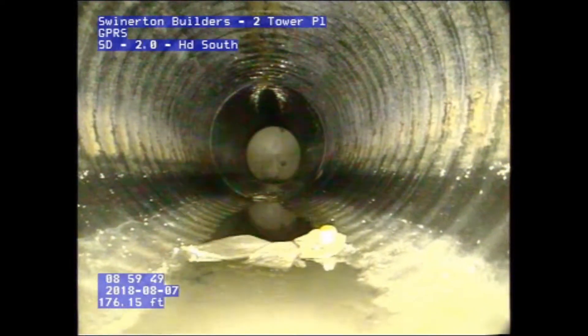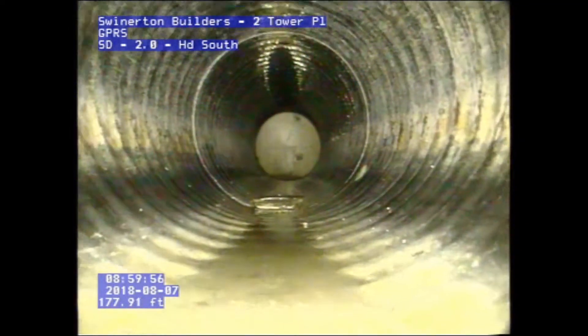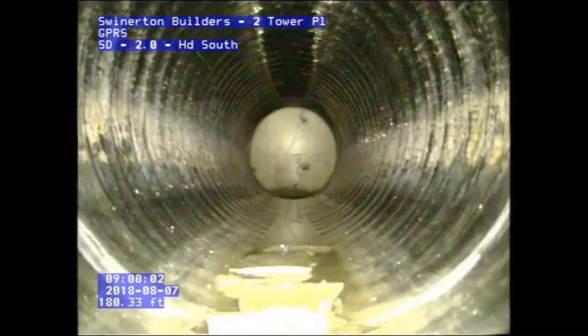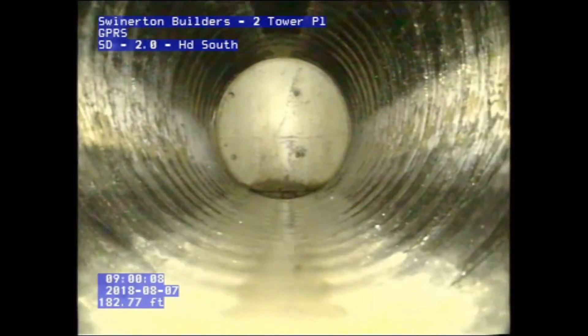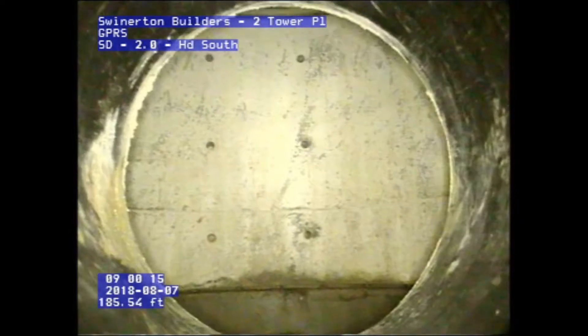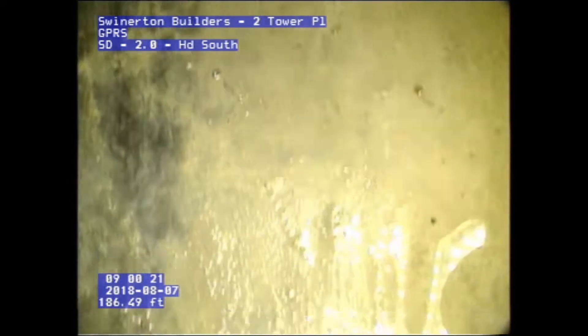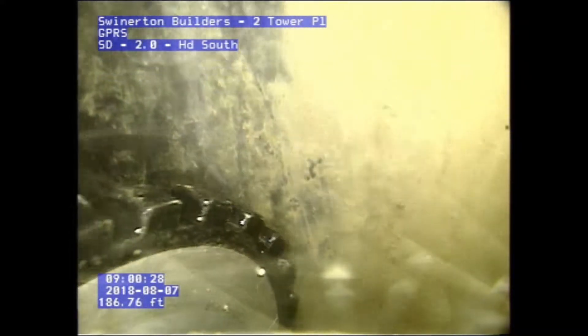You can see that we're coming to a manhole here shortly. There's some small debris in the pipe, but since we're not documenting that, we're just looking to find this buried manhole. Once we get to the opening, you'll see we look at the tires of the crawler camera so the operator can safely get as close to the manhole without falling in. Crawling forward, we'll be able to get all the way to the edge. That will help us when we start using the sonde attached with the camera to locate exactly the location above ground where this buried manhole is.